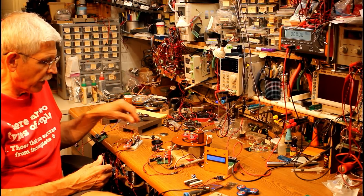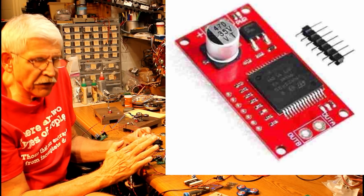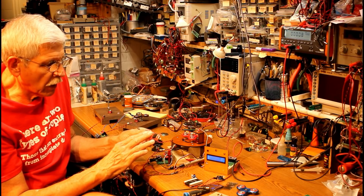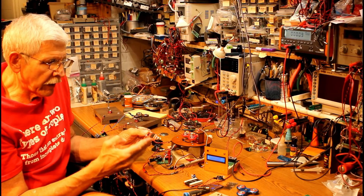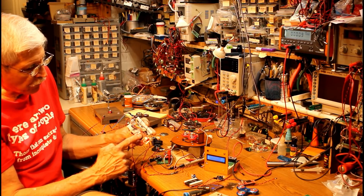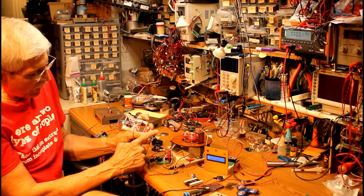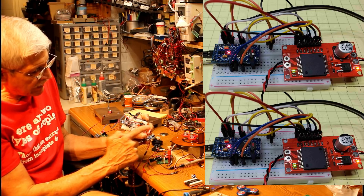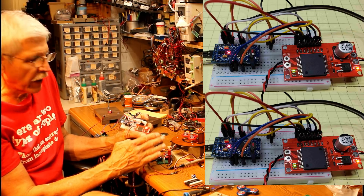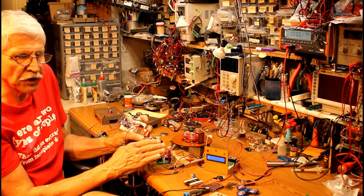How do you do that? There's a device called an H-bridge. An H-bridge is a series of four transistors — in this case MOSFETs — and they operate like a double-pole double-throw switch. It will electronically change the polarity of the output voltage. When I run my finger across the sensor, those lights indicate the polarity coming out: on one side it's pulling the magnets, on the other side it's pushing the magnets. And it can do that up to about 20 kilohertz, which is way more than we really need to worry about.